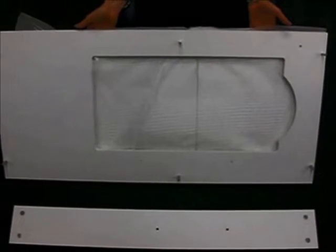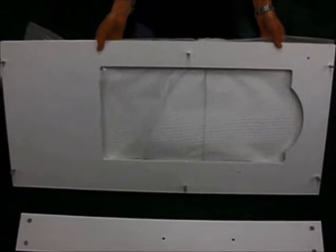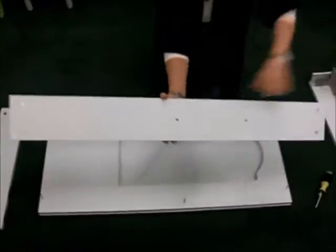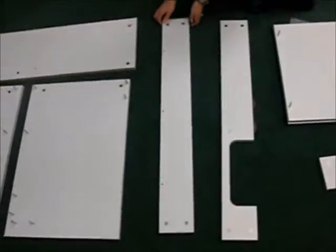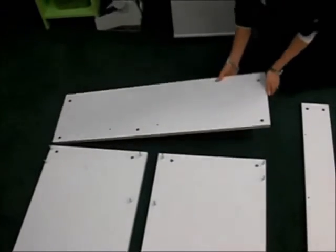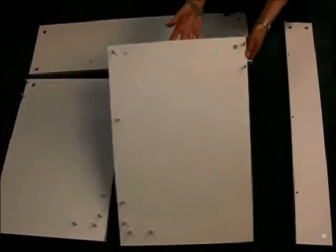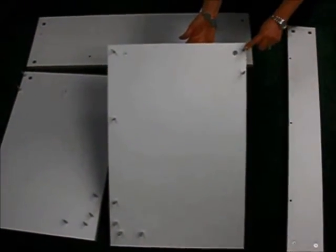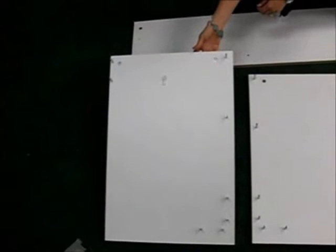You will start with your 7 wood pieces and 22 cams and connecting bolts, installing as follows. In the cabinet top, which is upside down, 6 connecting bolts. The back brace, I, 4 cams. The front panel, G, 5 cams. The shelf, O, 4 cams. The back panel H, 5 cams. Right side panel F, 8 connecting bolts, 2 cams. Left side panel E, 8 connecting bolts, 2 cams.